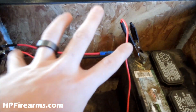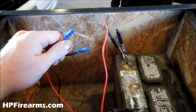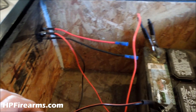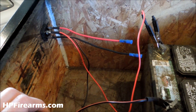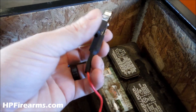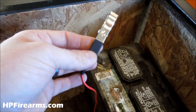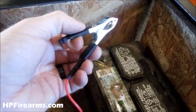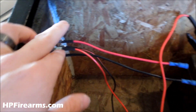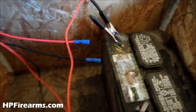The wiring for this will be contained in the box. The wiring for the generator itself will be contained in the shaft, the center spindle shaft, and the vane frame — making a quick disconnect to pull the battery box out if we need to change the battery. I've also soldered on some Gator clips, and used heat shrink because the covers that come on these are pretty poor. I used some 3/4 inch heat shrink, cut it to fit, and shrunk it down for a nice clean look that'll last a lot longer. All connections around the wiring are heat shrunk and good to go.